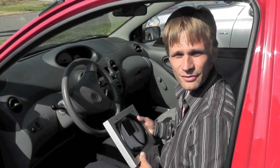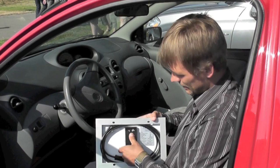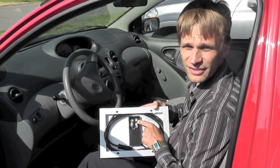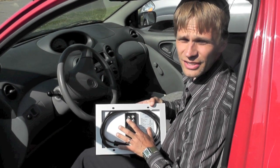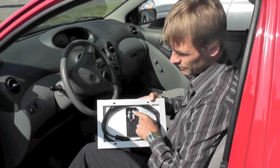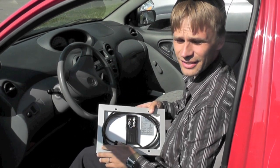To make this a solar battery charger, what it has in it is a blocking diode here. This makes sure that at night when the panel's not charging the battery, the charge won't escape from the battery through the panel. If this wasn't here, then your battery would discharge through the panel at night.